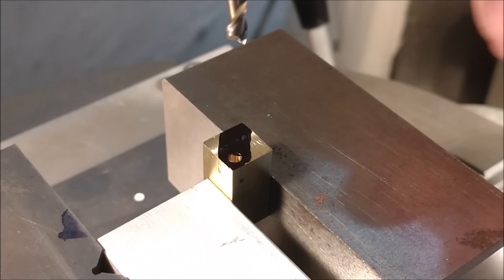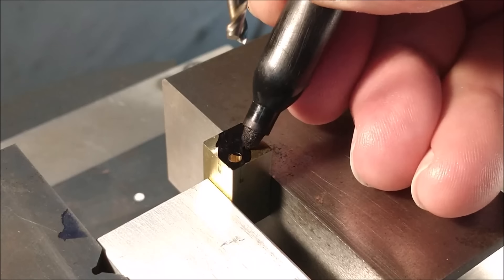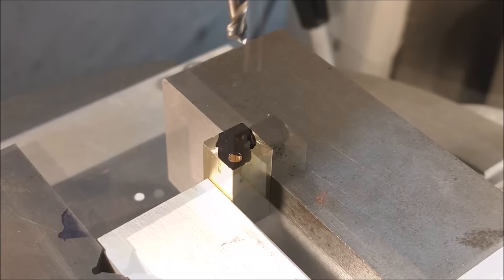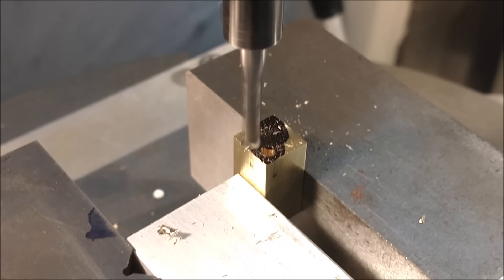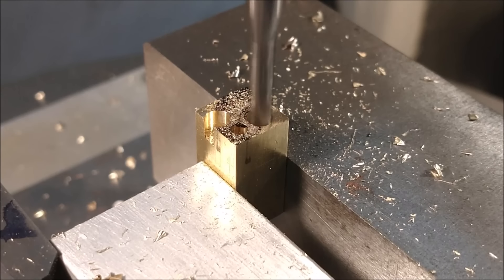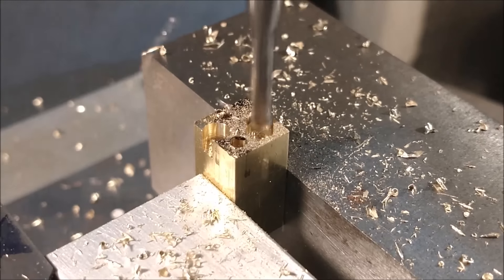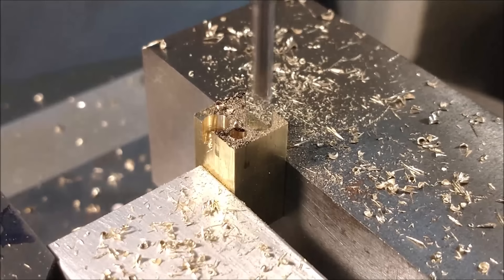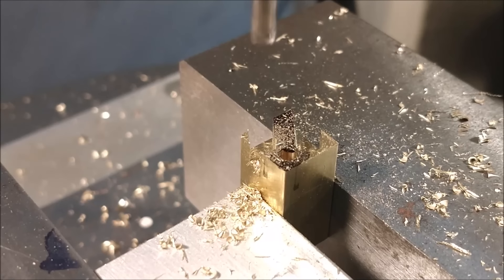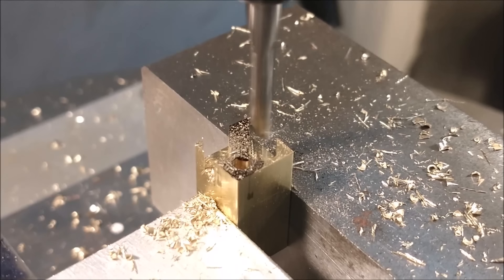The very first thing I'm going to do is take this end mill and plunge it to a final depth that's thicker than the end flange — two holes right here — then I can draw it out and be done with it. One important note: if you are plunging an end mill with no pilot hole, no smaller diameter, and no relief in the middle, the end mill has a good possibility of cutting oversize. Even a couple thousandths oversize will show up like an undercut in your part. So do yourself a favor — stay a couple thousandths away from the final location before the operation, then move to final position and make your final cut.